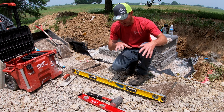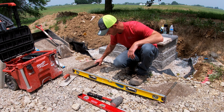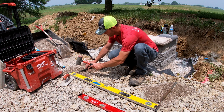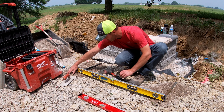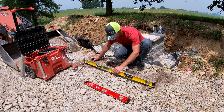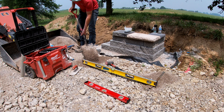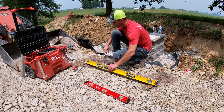In other words, that's that time-consuming, gut-awful process that if you've been in hardscaping any length of time, you set one block down on your base, beat it into submission, pick it up, level it, and you do it block to block to block — it's the worst, it's a terrible way to do it. I know people did it that way, and I did it that way for years, and then we figured out the screeding concept. So we're reading not level — we're going to take this, tap it down, getting it level. Now I'm too low, but that's easier to fix than being too high. When we're too low it's easier to pick it up, so we're going to pick the bar up. Our base in theory would not be perfect here, and we want to have our base closer than that.